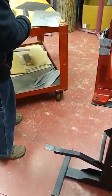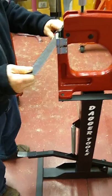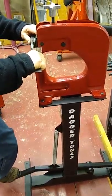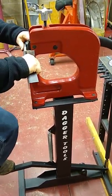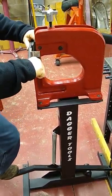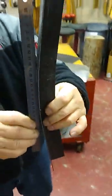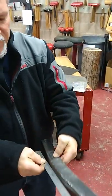We're going to do the same thing and jump over to 16 gauge. We'll start with a 16 gauge angle and interlock our forming zone, making sure that our shrinks are on top of each other. By grabbing our straight edge again, we can see how quickly we can create an inside curve on this piece of angle.